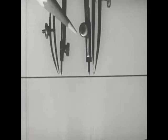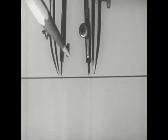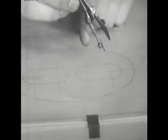The pivot points of the bow pen and the compasses should have shoulders to prevent large holes in the tracing. The pivot points should be slightly longer than the nibs of the pens. The diameters of the pivot points of most bow pens are smaller than the pivot points of compasses. For concentric circles, the bow pen should be used before the compasses.